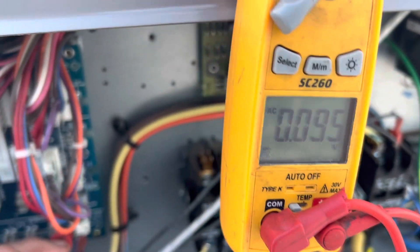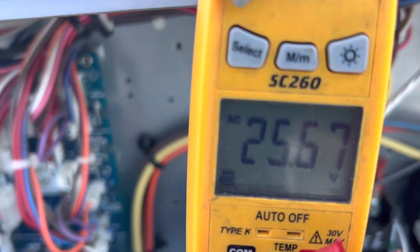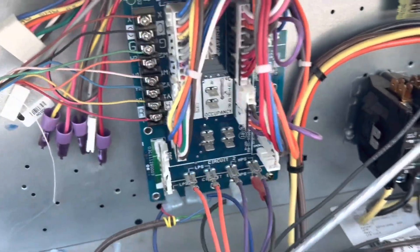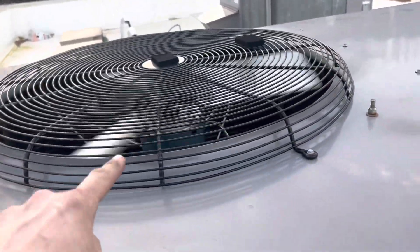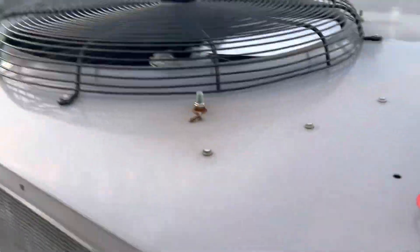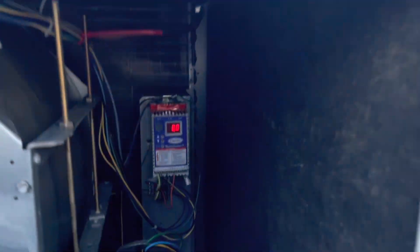Low pressure zero — we're good. The safety circuit is open, then that contactor is going to pop out and you're going to read 25 because we're off on high pressure. There's an intelligent controller that's supposed to adjust this fan speed with the pressures and it's clearly malfunctioning, because I can feel the heat coming off of that thing. We've got a bad motor master.